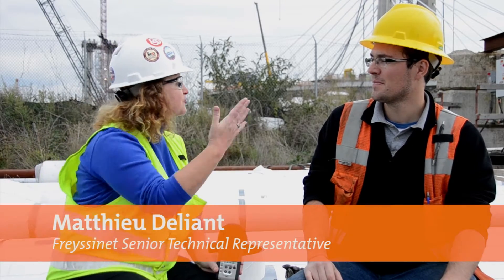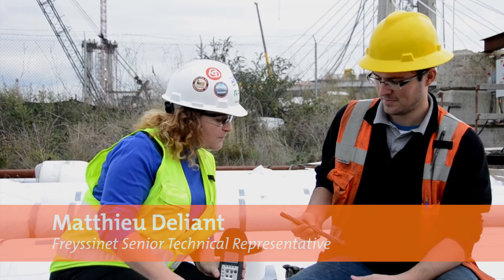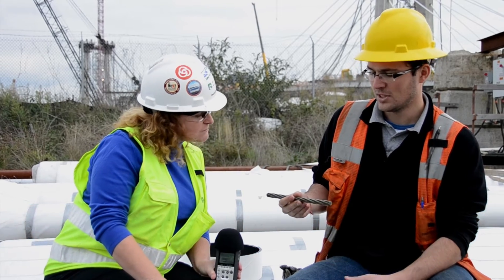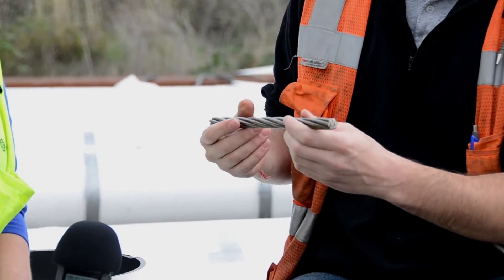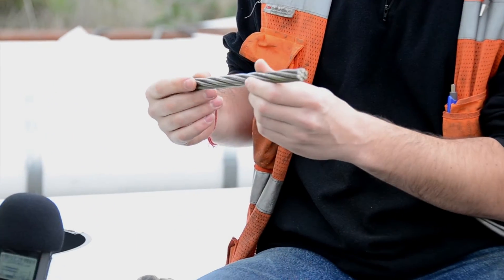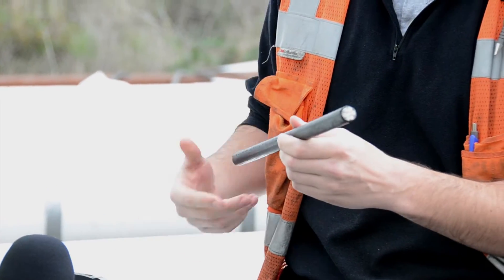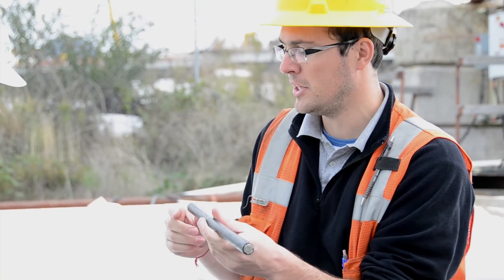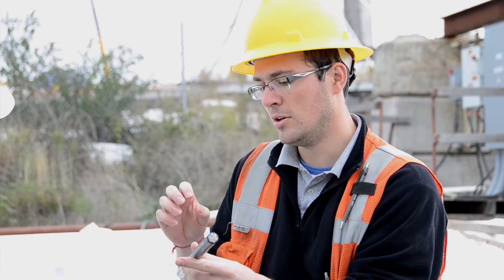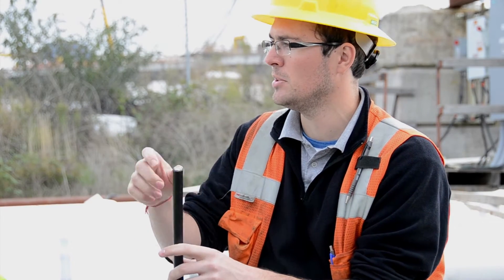So let's talk a little bit about the strand — that's kind of the star of the show. The strand is really the basic component of stay cable bridges. It's just made of seven wires twisted together. In one stay cable you have several strands, and each strand is protected by a double layer protection: a black plastic and a resin filling in between the wire.